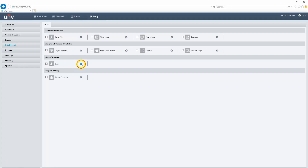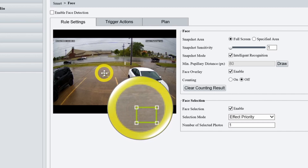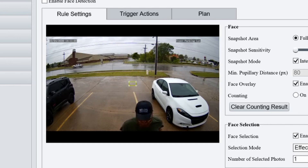One important thing to note about face detection: if I click on the gear icon and jump into settings, we do have a minimum pupillary distance of 80 pixels. I can click draw and make that number bigger — up to 500 pixels — but I cannot make it smaller. So for this 4K turret we are limited to an 80 pixel pupillary distance. What this pupillary distance is, is going to be the distance between two eyeballs. So from where I'm standing outside, you can see that my face is quite a bit smaller than this 80 pixel box. From here, this camera is not going to be able to detect my face. As I start walking toward the camera, right about here looks like it would be about the right size, but by the time someone gets to this point they're only going to be on screen for a very short time.